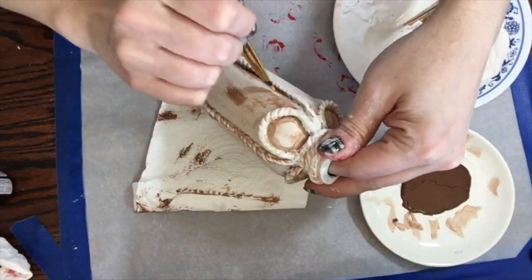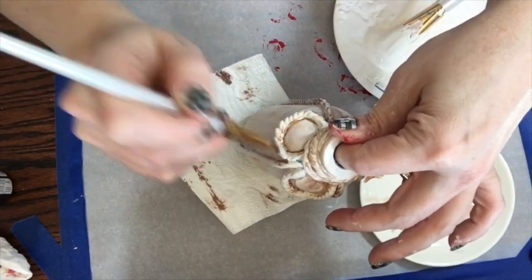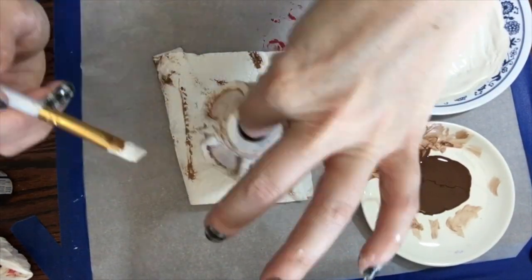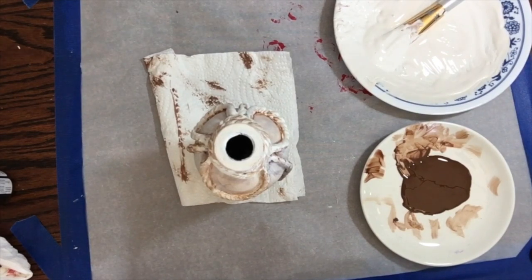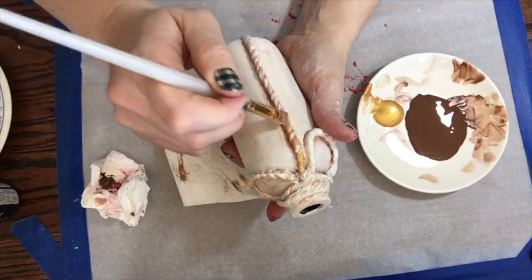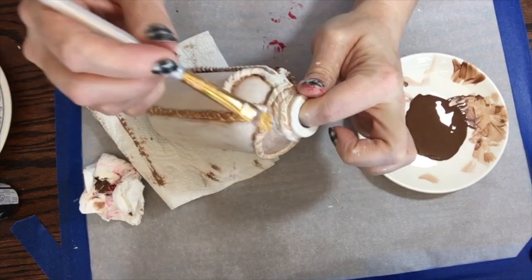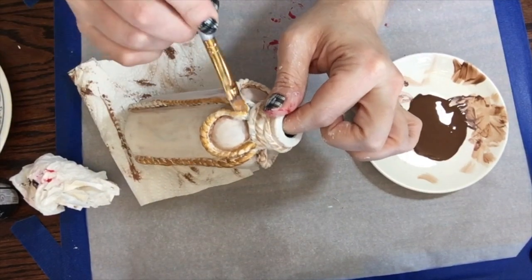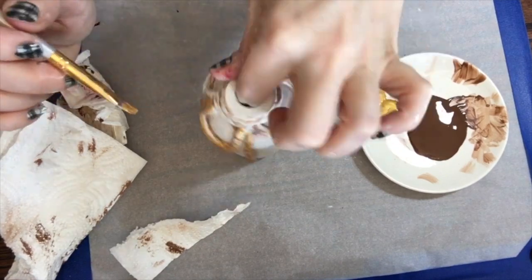After I got the brown on there — it was pretty stark — I went back to that original color I kept on hand and started touching up where I thought there was too much brown. It's rather see-through, so you can still see the brown underneath, which gives the appearance of a stained look. You can go over it as many times as you want to hide the brown, but with this technique I really wanted the brown to pop. On the decorative pieces I put some gold color on top, and I didn't do heavy coverage — I went back with a paper towel and wiped some spots and left them white to give it more of an antique feel. You don't want them to look perfect; you want it to look like some of the color has rubbed off over the years.